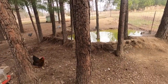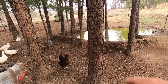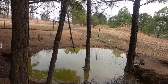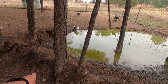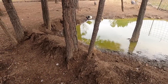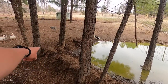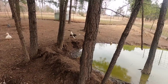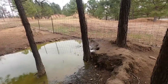This is what it looks like about half a week to a week later. The berm's pretty well dried. I need to go through and put some more material on the back — I'm thinking of backing it up with some cinder blocks, filling it in, and tamping it a little more to reinforce it. Over time, just water coming up and the ducks messing with it — it was a lot bigger. You can see where they've broken through it. It's too hard for them now, but once it rains they'll start scooping in there eating seeds and junk, so that'll be a weak point. I'll back that up, tamp it with cinder blocks or sandbags, and run a little cut so that once the water raises it just evacuates to the side a little better.